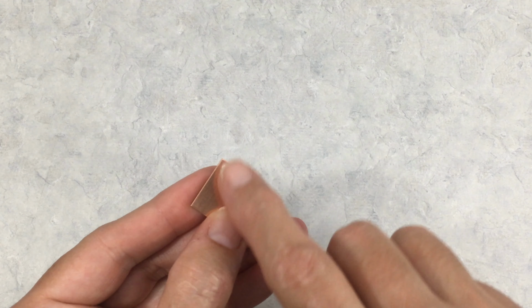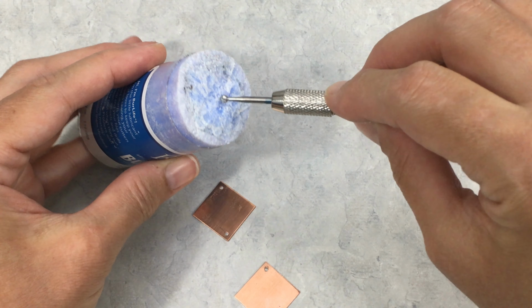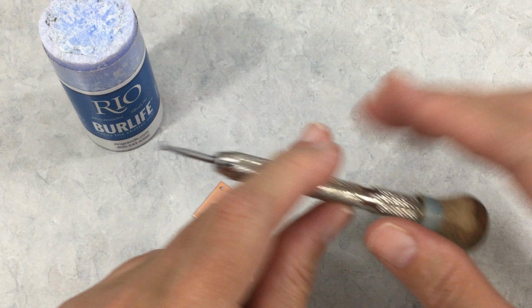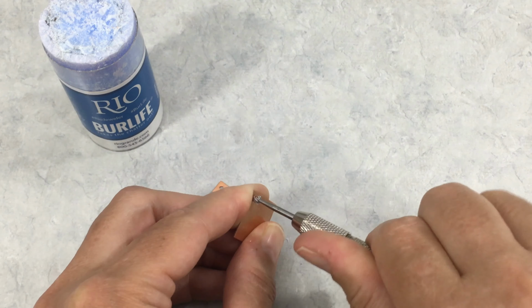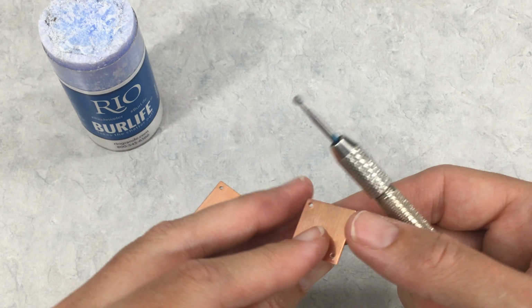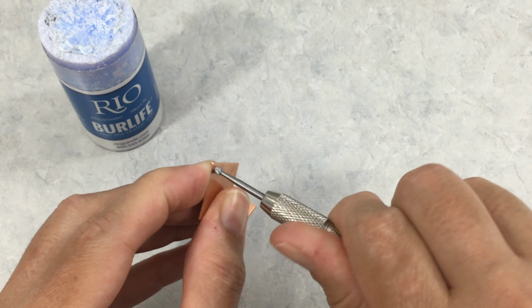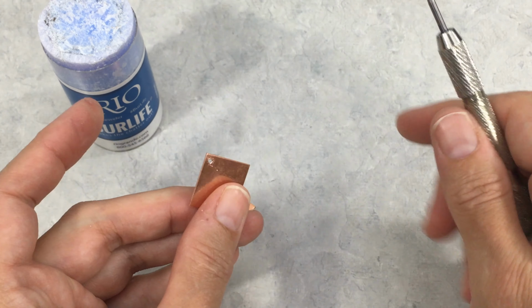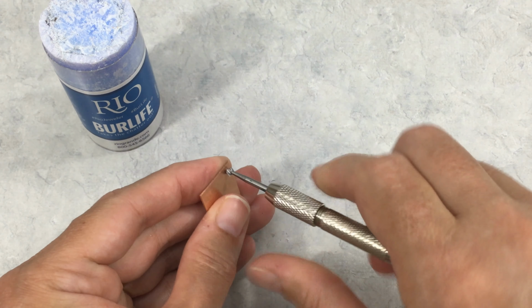But now if you rub your finger on the back side, there's a little flange that's left from the hole punch. And so I'm going to use my trusty round cutting burr fitted into a handheld pin vise, and I'm going to use that with a little bit of lubricant to clean up the back side of the hole. You can see that by spinning that in place, that's allowing me to clean off just that little flare of metal that's left from punching the holes. If you want more information about the specific techniques on how to punch a hole, how to set up the tool using the pin vise with the round cutting burr, that kind of thing, I do have another video that's specific to that, and it is linked in the description below.